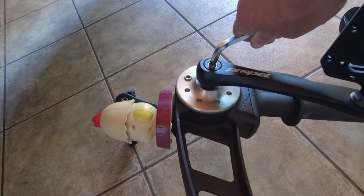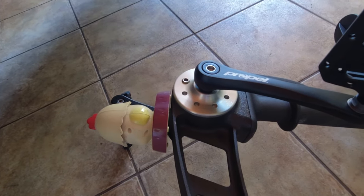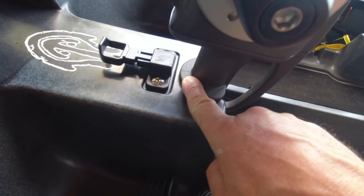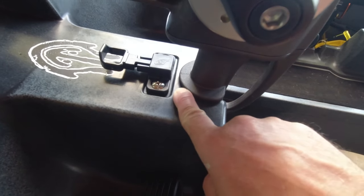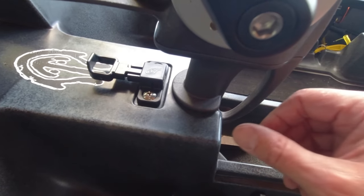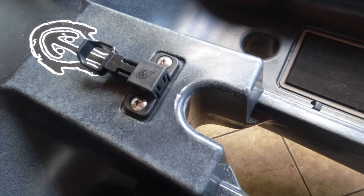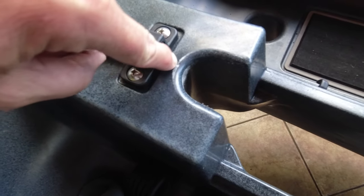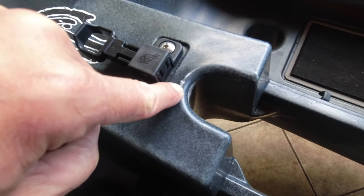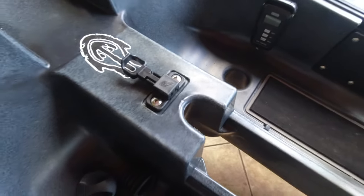Make sure you do both sides. Watch the video I'm going to link. After you do that, you're probably going to have some more squeaks. I'm going to show you what to do about that. The base plate was rubbing into the kayak here, rubbing off the plastic, because as you pedal this slightly rocks left and right. I'll show you the wear — this is eating into the plastic, especially because that base plate has a powder coat that's very coarse.